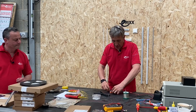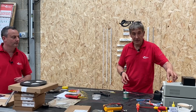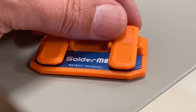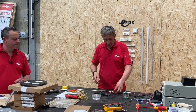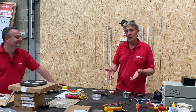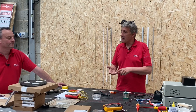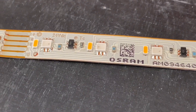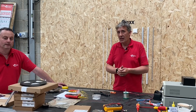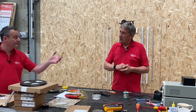Some of the little features to look at — depending on where you're working — there's a magnetic base on the back. So I'll just drop that on the top of the power supply there. If I was doing a lot of this at my workbench, I'd probably put a bit of steel on the bench to make it even more secure. Obviously this is single-colour LED tape with huge pads, relative to when you start looking at RGB LED tape. We've actually got some RGBW LED tape, where you've got a common connection and then four individual circuits — that's five solid connections to make. That takes an incredibly steady hand, probably a smaller tip on the solder iron, and maybe that's a challenge for a future video.